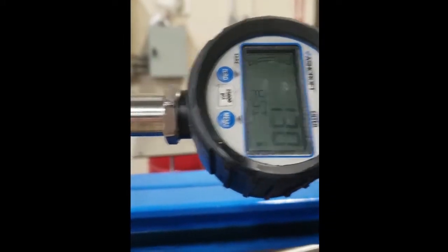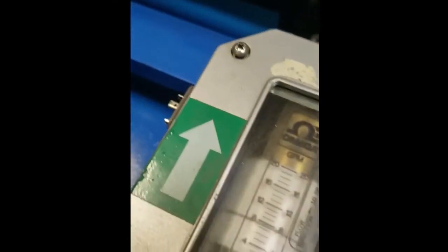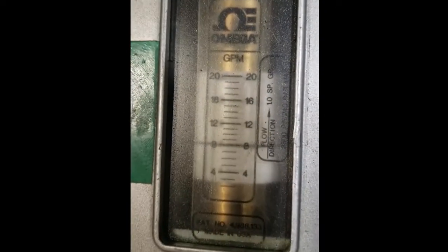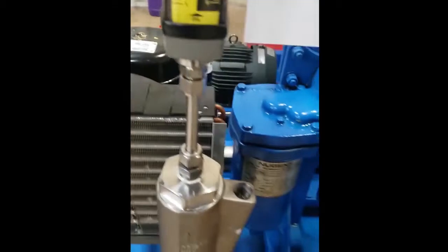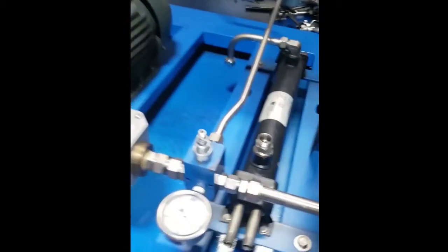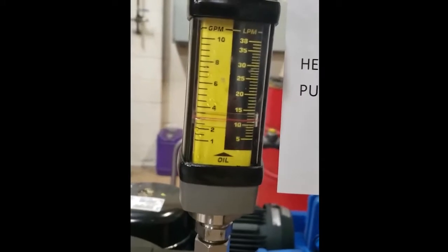They're operating at the same pressure. What we have going on right now is a positive displacement pump. That header line pressure over there is about 600 psi and we're getting about 8 gpm of flow. The flow coming off the pump — some of it is being diverted through that relief valve down there, so of the 8 gpm, 2 is actually going through that relief valve back to the tank, while we have 3 gpm occurring at each line.